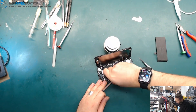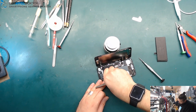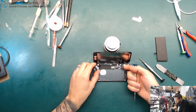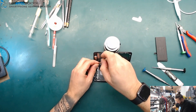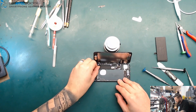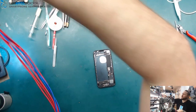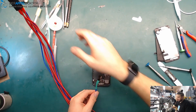So I get out the rest of the glue here. Then I want to get out the screen, then go to the power supply and let's see where the problem is. Normally, when I read that the phone was shutting down from one moment to the other, I think about a short on 3v0 NAND, VCC main, or RAM.